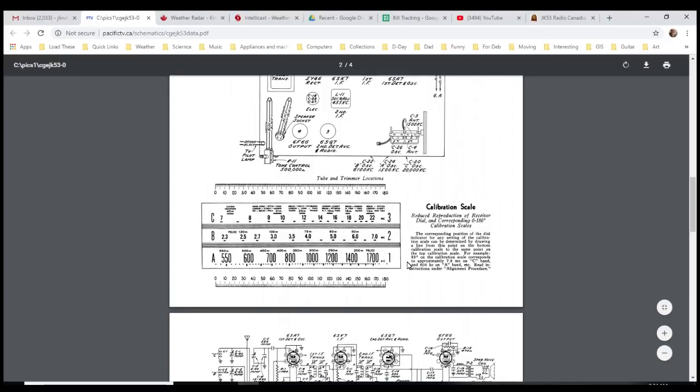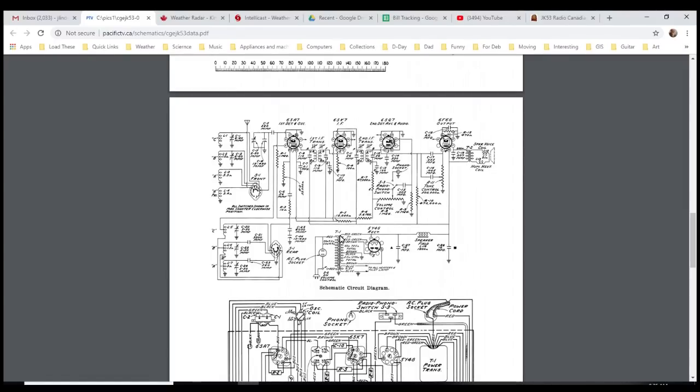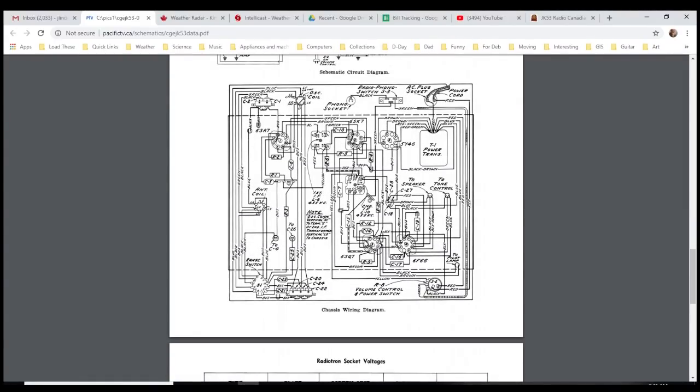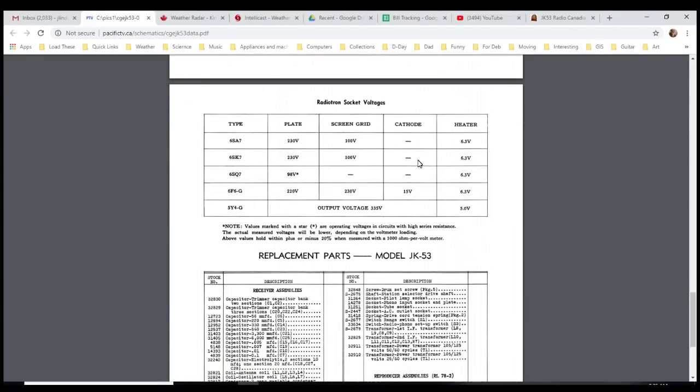Here's the dial on the face of the radio. This is the paper scale stuck on the back of the big wheel of the tuning capacitor. It says right here, you can lay a ruler across here and find out that 70 on the paper means 10 on the scale — that kind of thing. Here's the schematic, we're going to be going through that shortly. Here's a component and wire layout diagram. These aren't terribly common, but they're really handy — they show you how things should be laid out. There are some important warnings in this manual too.